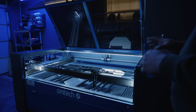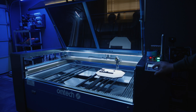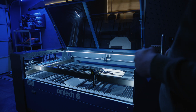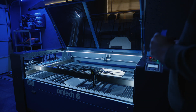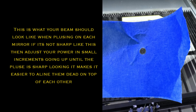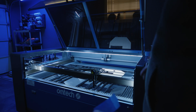First things first, you want to know your machine. This is your controller here, then you have what I call the back of the machine — because I'm standing at the front of it right now. We'll use front and back throughout this process. You'll want to get some painters tape — just regular blue painters tape. I always double the tape; that keeps it from burning and lets you turn the power up to get a nice solid dot without burning through, so you can see exactly where the beam is landing. You may need a flashlight when using doubled tape.